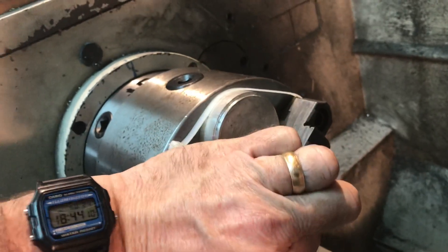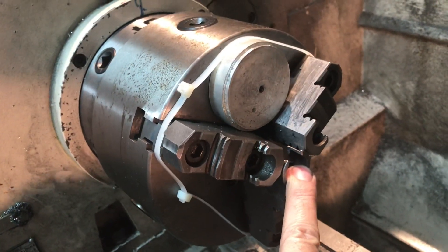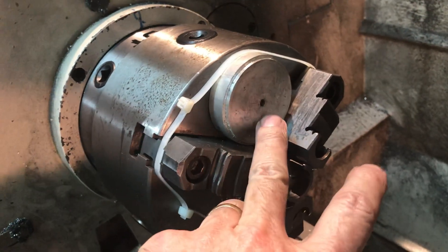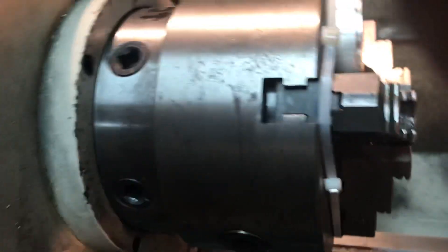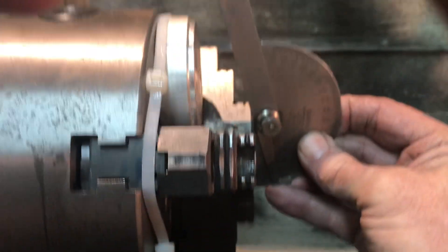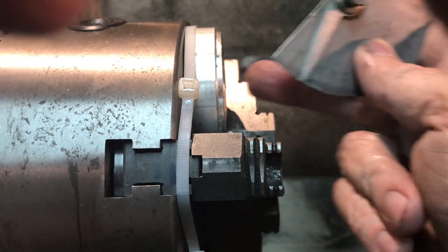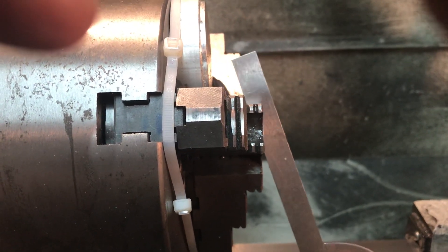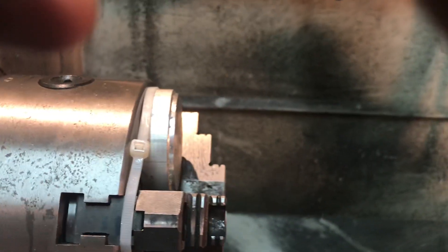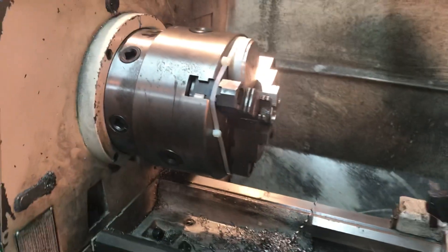Machining ten handles isn't that big of a deal. The cup is still stuck in there pretty tight. I'll put the half inch cup in — this is the three-quarter inch cup — and I'll have to play with the angle. I have a little angle device here. I just set this here and watched the angle of the handle when it was inside the chuck, then adjusted it by playing with different things in the back. For the smaller handles to get a similar angle, I'm going to need a thicker standoff piece. That's a little update on the ball handles.